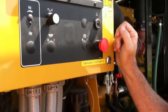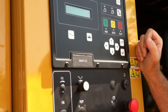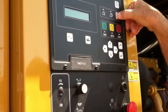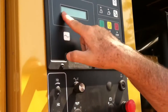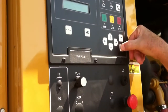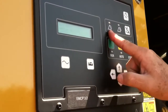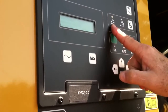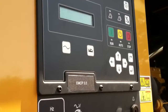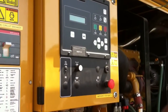Now it's back into active position. I've got to put the unit in stop, so I'm going to put it in stop. I'm going to push this reset button again. It's going to say reset all events, and it gives you that symbol which is our enter key. I'm going to push the enter key, and it cleared the fault. However I still got that one, which is our not in auto. So I've got to go back to auto, and it puts that light out. So that is a quick synopsis of what happens when we have a fault.